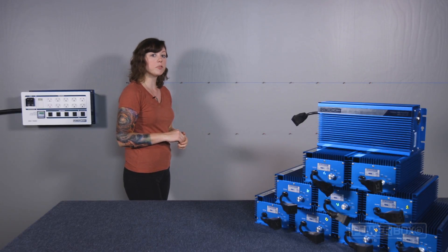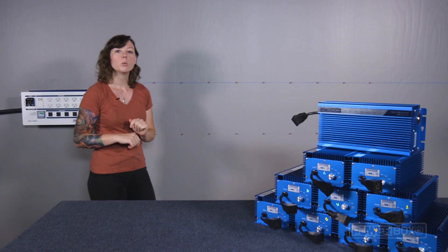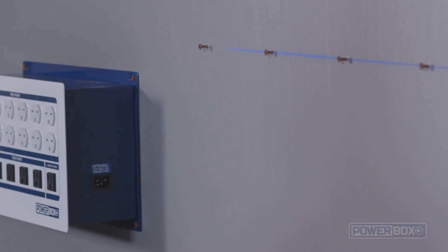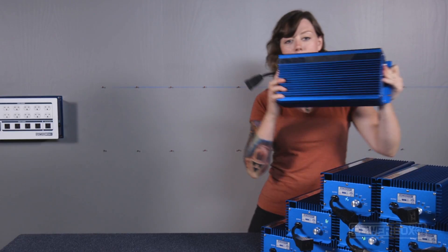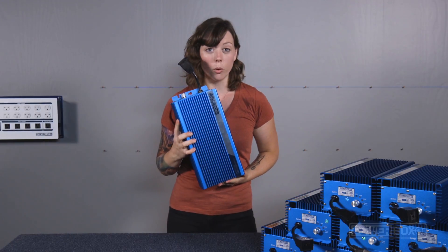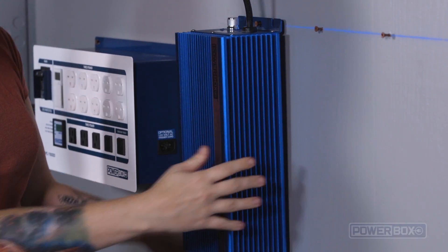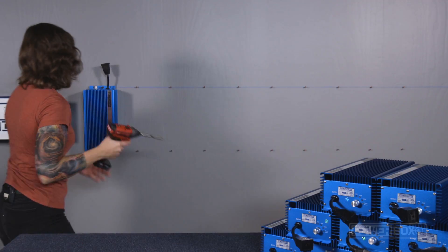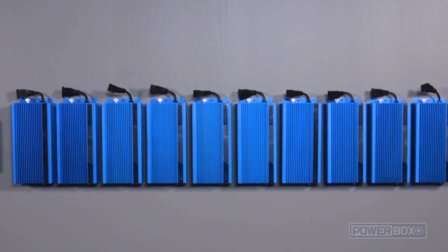Using this level guideline, we've marked the positions and installed screws that will hold the ballasts. We want to keep some space between each ballast so that the air can flow freely — about an inch between each one is perfect. We are going to position the ballast so that the lamp receptacle is on the top and the power entry is on the bottom. Slide the first ballast keyholes over the screws and make sure it is level. Then tighten the screws down carefully so that they are snug.